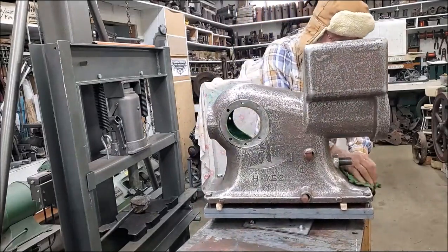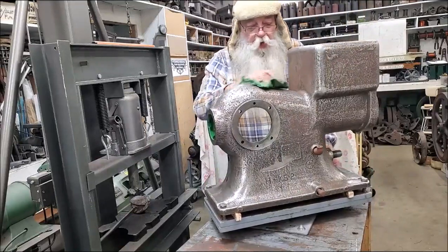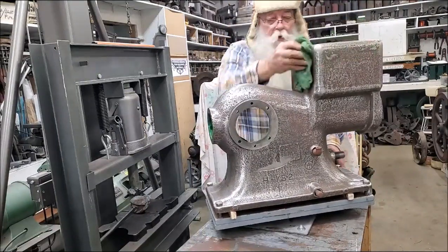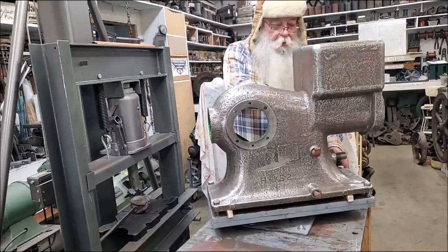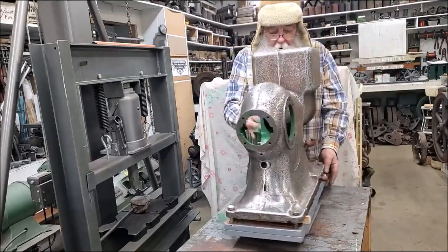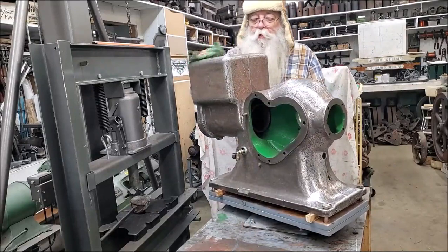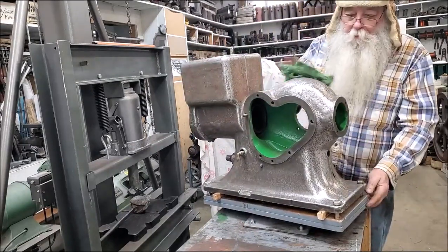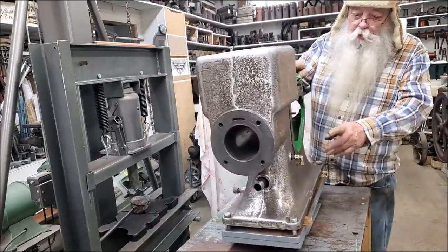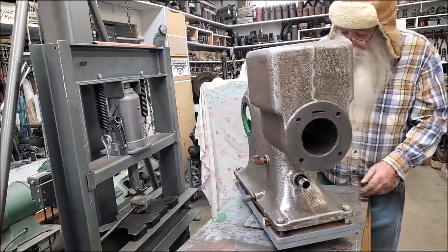Generically referred to as a hit-and-miss engine, as it's in that genre style of engines. In this particular one, the magneto being an American Bosch, with the points built into the back of the magneto there. In that setup, you only need one cam lobe, as the timing is indicated by the magneto gear.